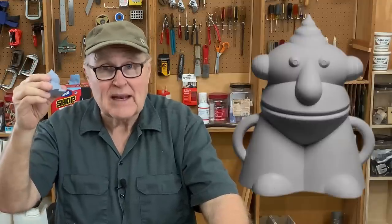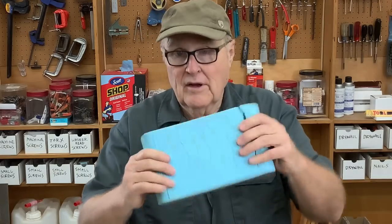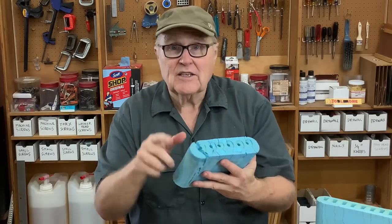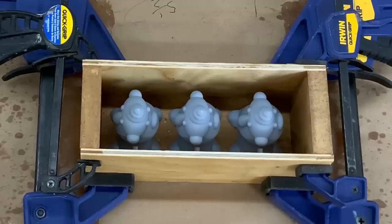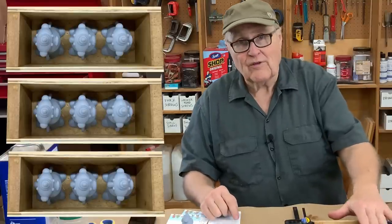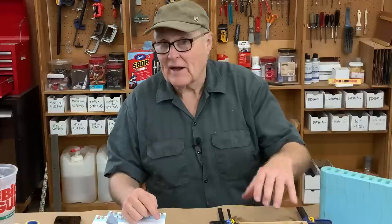That means I can make six castings per hour compared to one printing every hour and 14 minutes. When I'm pouring pieces in production, I like to have 10 cavities, or at least six or eight cavities per mold. For this mold, I would make two or three more, so I'd have a total of six or even nine cavities. With six cavities cycling twice an hour — 12 an hour — in a single workday of eight and a half hours, I could produce 100 castings. That's enormously faster. If I made three molds with nine cavities, casting 18 an hour, I could do the entire 100-casting job in five and a half hours. This is why nobody operates a single printer and makes any money — if you're going to do printing, you're going to have a print farm, because you need a lot of machines running simultaneously to come close to the casting rate you can reach with resin casting.